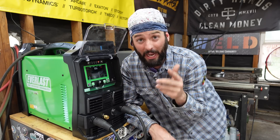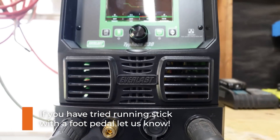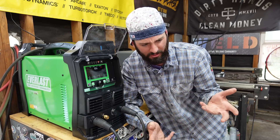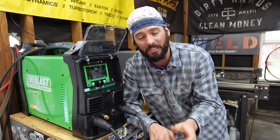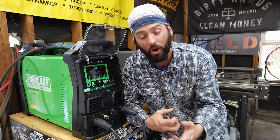What's cool is you can now hook up a remote to your stick welding — if you wanted to use a foot pedal, you can actually run one. It still has the VRD safety feature and anti-stick. I was like, what the heck is anti-stick? It senses whenever that rod is stuck to a crater, or if you stick the rod, it makes it a lot easier for that rod to be removed afterwards. It keeps it from sticking so hard inside that puddle — that's a really cool feature.